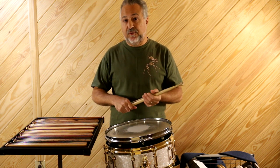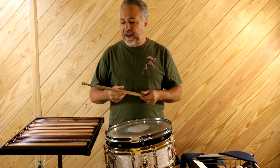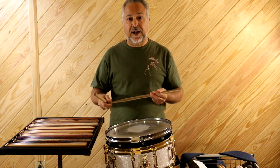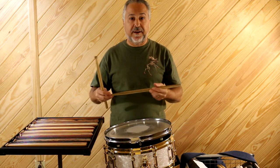5% is hard to get to. You got to really dry it out in the kiln for almost a year to get that dry. And that makes sure the stick won't check, which means crack. It won't warp. These are perfectly straight, as you see, all my sticks are. So I'm really, really careful. I ran into that when I was younger and started making sticks, and I didn't know too much about that, and I had all kinds of problems. The sticks would bend. It was a nightmare. So I learned really quick, and now I'm kind of an expert on drying wood.